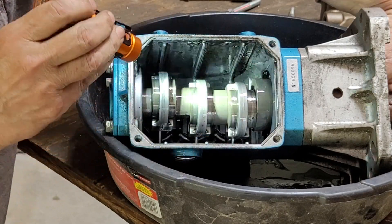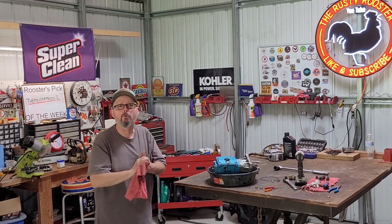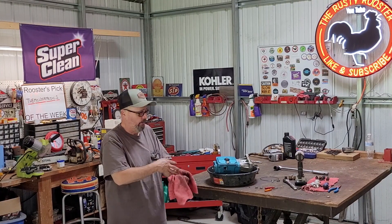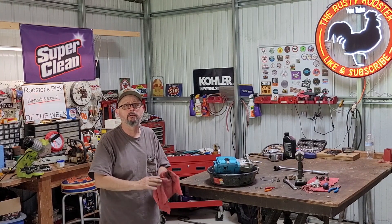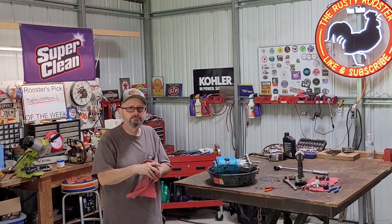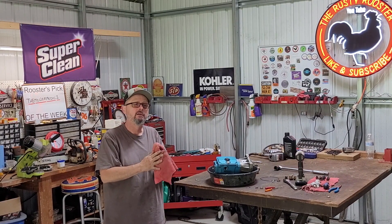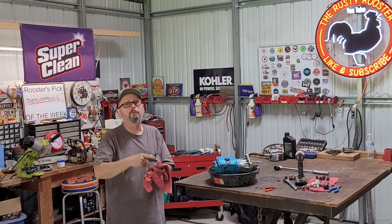We've covered the fluid in on the head of your pump, fluid out either side, your series of check valves, how the pistons cycle, what to look for on these pistons as far as any cracks, making sure they're sealed, and sealing the oil seals from the crankcase to the water side. The back side of your drive system — all we want to look at is how that's driven. It's driven just like an automobile — it's got a crankshaft and connecting rods. In order to remove these rods, you're going to pull the crankshaft out. I hope that answers a couple of questions about how a plunger pump works — pressure washer pump, call it what you will. This is only one example of a drive system. There's direct drive, belt, gear, and then you got the lower end consumer equipment that's got a little swash plate in there that drives the pistons back and forth — essentially doing the same thing at the end of the day. I hope this was informative. If you thought it was, how about getting that thumbs up? Subscribe. We'll see you next time.